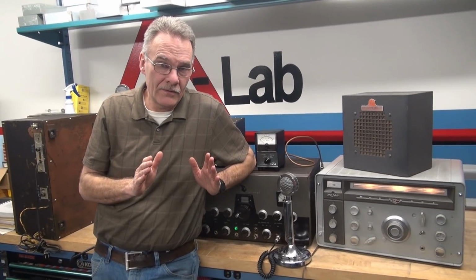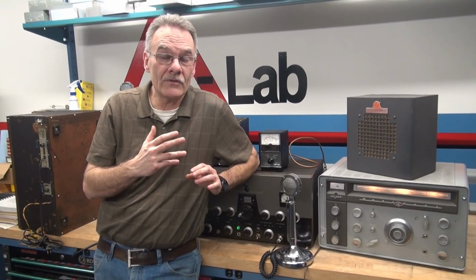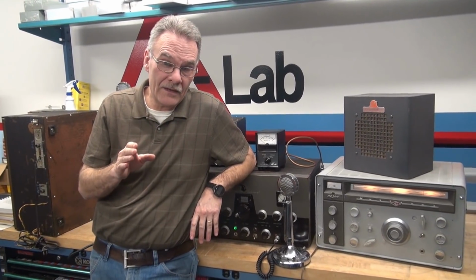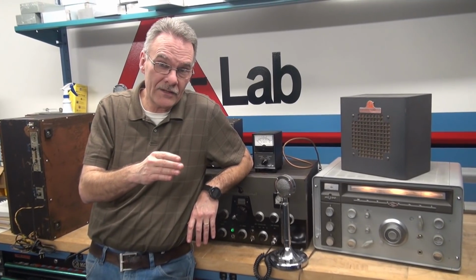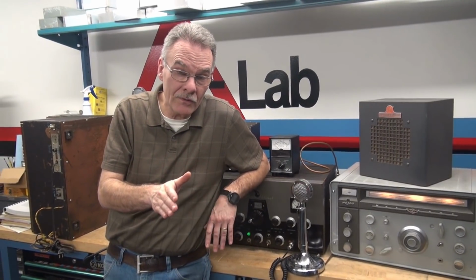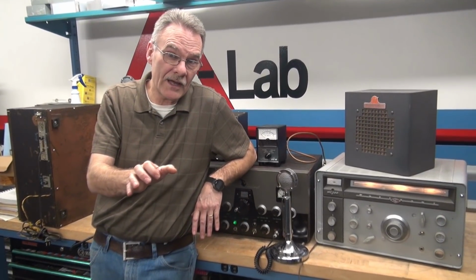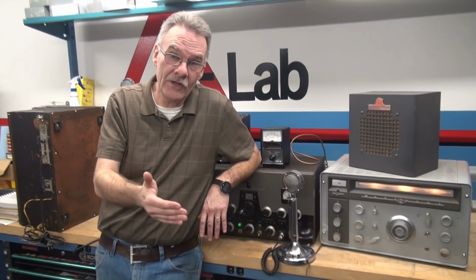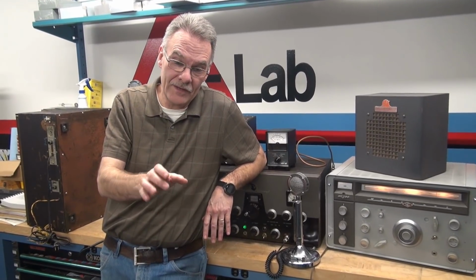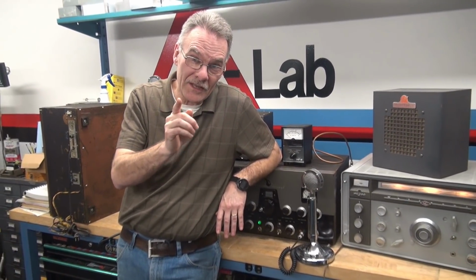I can't stress enough the use of a Dow Key Relay with the external contacts rather than some of these generic devices that you're seeing out there for sale on the internet, because the Dow key allows you to physically see those contacts moving, and you can actually adjust them to make sure that your receiver doesn't bark at you like I was telling you about, right? If you buy these other devices that have like an ice cube relay inside and they switch plus do the muting, you have no adjustment. And if that device fails, it can be catastrophic because you have the RF and the muting together in one package. So just think of that failure.